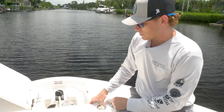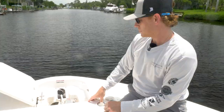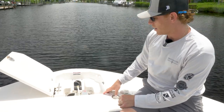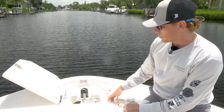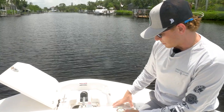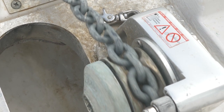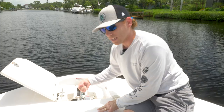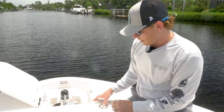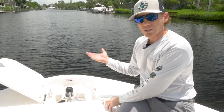If you start to hear this struggling or see the mechanism pulling up, that means we're giving too much tension and need to get more slack off the line. Some tension is normal — if we've been here four or five hours, the anchor may be dug in. A common issue is when the splice that goes from line to chain occasionally gets stuck in the windlass mechanism. Sometimes it's best to let it down a little bit and come back up. If it's still not going through, you may need to reach underneath and put a little tension on the line. When you know you're getting close, take a peek over the bow and make sure the anchor is facing the right direction.